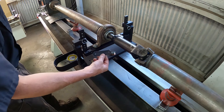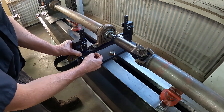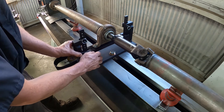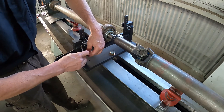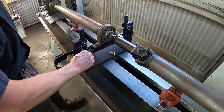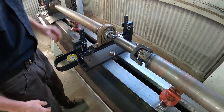We also have a locking tab, and that tab can be bolted in place right here if you're going to check the driveline for straight or do any kind of heat straightening. You'll want this locked up in a rigid position. Once that's locked up, you have it nice and rigid where it can't move, and you can rotate the shaft for checking for straight.